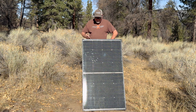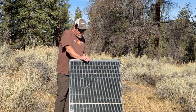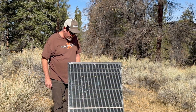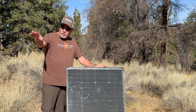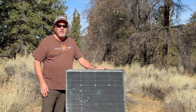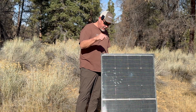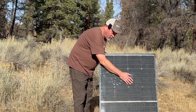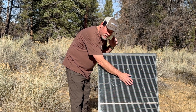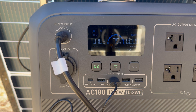Here's something cool about this panel — we talked about it being two separate halves. Most panels, if you shade even a section, you almost kill the panel with hardly any power coming out. But because this one has two 100-watt halves, I can shade a big portion in the middle, the panel resets itself, recalibrates, and then starts making power again. Watch it ramp back up: 105, 106 watts — even with that much shade.